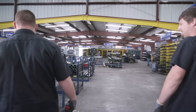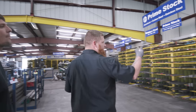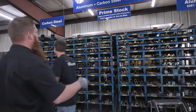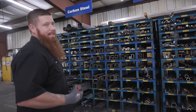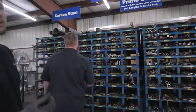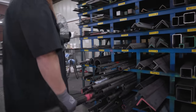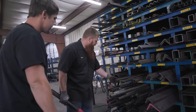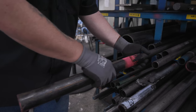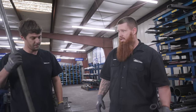Over here in the prime stock aisle - this material is all inch and three-quarters, which is close to what we need but won't do it for us. We've got some extruded aluminum shapes and different pieces. This facility will actually cut it down to size if you need it, though you'd probably pay per cut. Prime stock means you're paying top dollar and it's cut 48 inches or eight feet. I found some inch and a half - checking the wall thickness - and it fits perfect. Six to seven feet here should be plenty - we're a little bit over six foot. These are the only two pieces we need.